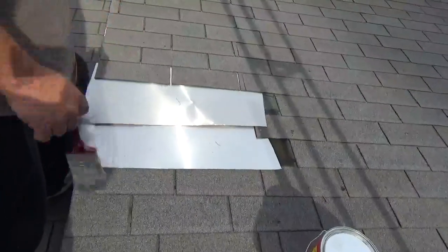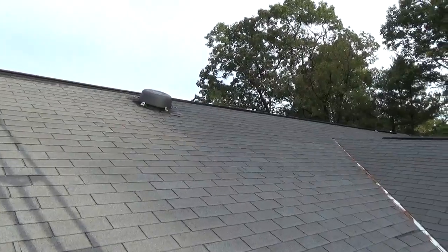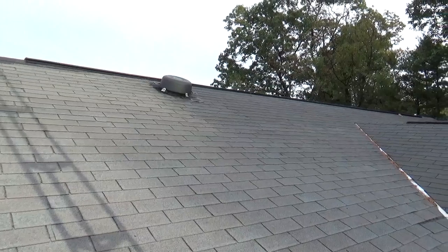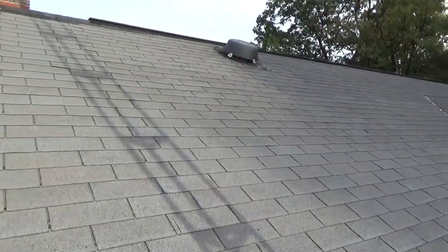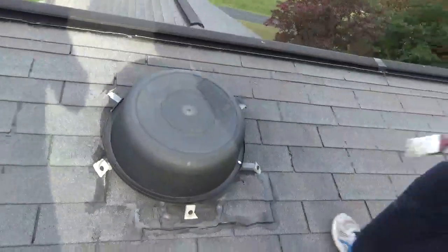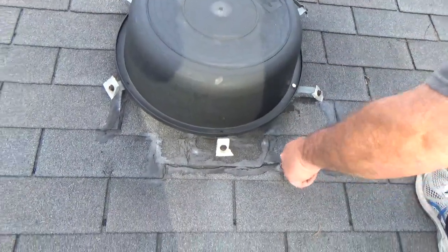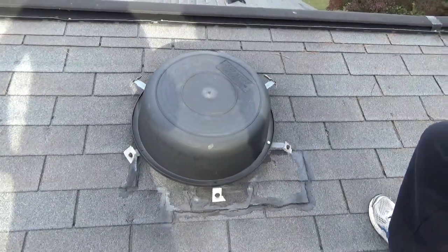So other than those two roofing spots where that mushroom is up there, there used to be a fan in that and the wind snapped it right off. That's literally a washing bowl, you know, for doing dishes on the top of the mushroom up there. So, but there is some cracking above it. They made the mistake here. I mean, there's not much of a problem with tarring the sides, but you really want to be careful about tarring underneath here, because any water that comes down, your tarring stops it, it backs up and it comes into the house. So a little roofing repair with old Harvey Spooner.